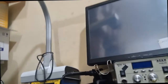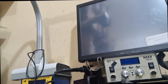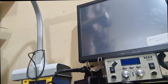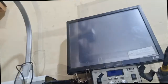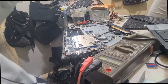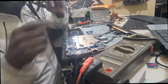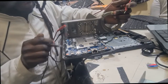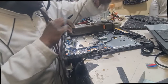We put flux on the board and prepare to work. We disconnect the power and prepare to change the MOSFET. Before removing it, we do one more check — we'll test the voltage again here to confirm. We'll put the negative probe back.